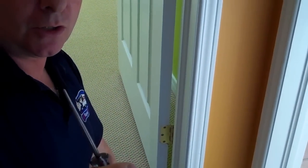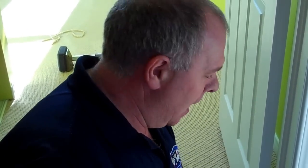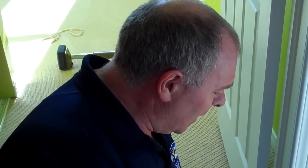Sometimes what us installers do to correct that — if you have cut just a little bit too high — when people are setting baseboards and cutting doorjambs, for some reason that quarter-inch rule all of a sudden becomes 3/8ths to half an inch. And once it's half an inch, it doesn't look that great.